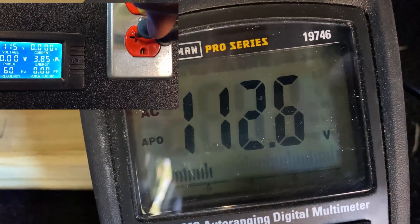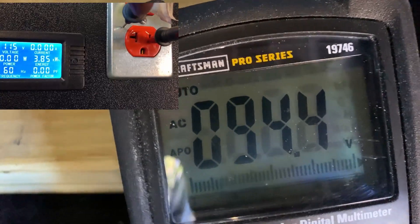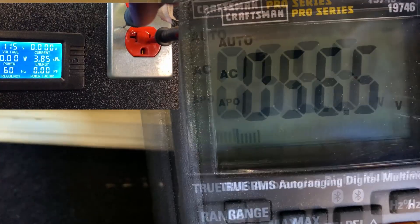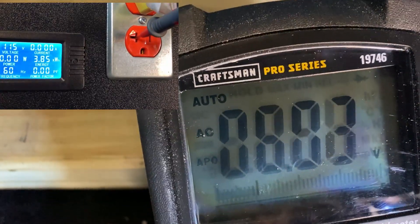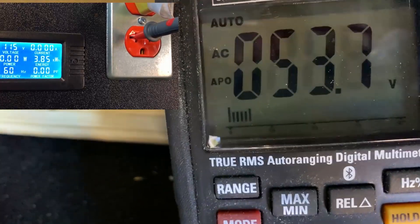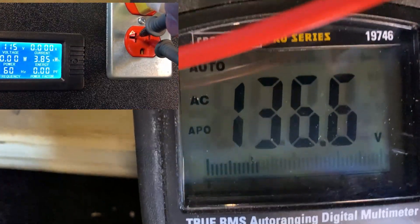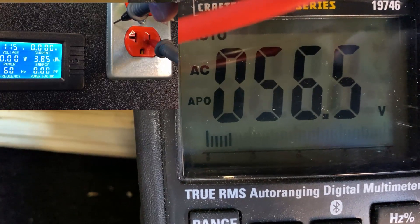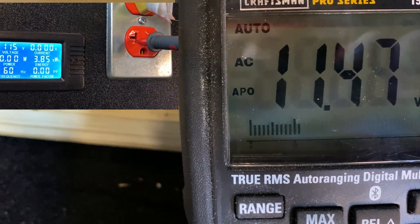Here's why I'm showing the setup this time. I'm still getting 112 volts, which is fine, but when I leave the hot connected and touch the ground, I get 56 volts — which doesn't sound right; it should be 112. Then I measure the neutral to ground and get 52 volts. Hot to neutral is 112, hot to ground is 56, neutral to ground is 52. Those add up to about 108, so I don't see that as being a real neutral.